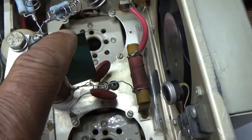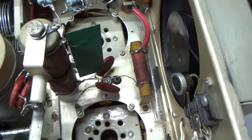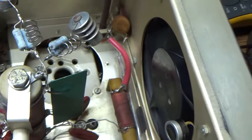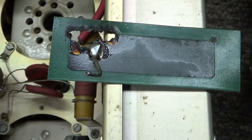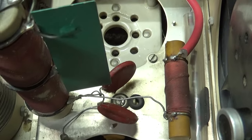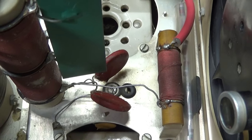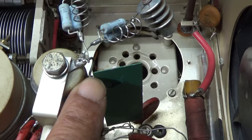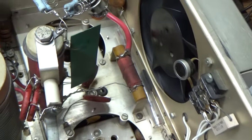I didn't want to get into too much theory. I looked it up on the net, saw a few videos, and also got a schematic. I saw that weird part and wanted a schematic, so I found one online. That is a 47 picofarad capacitor — that's all that is. And I'm like, that is one of the weirdest capacitors I've ever seen. I don't know why they have a 47 picofarad capacitor hooked from the top of the choke to the center of the choke, and it's engaged at all times — soldered in there.